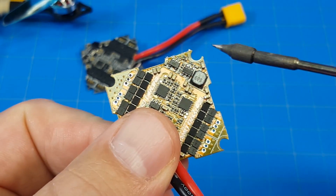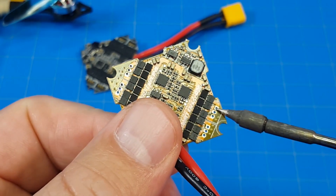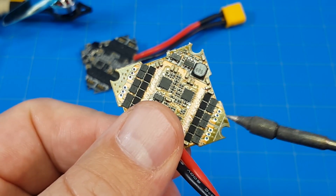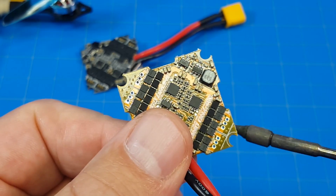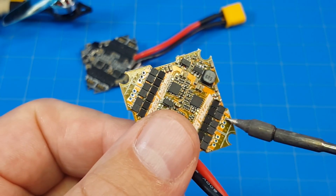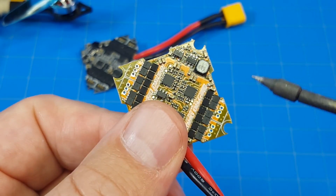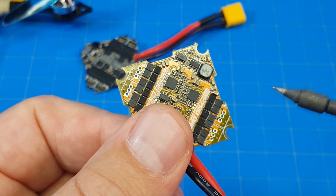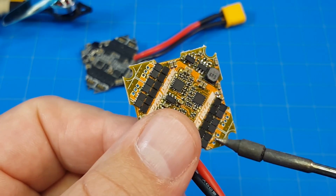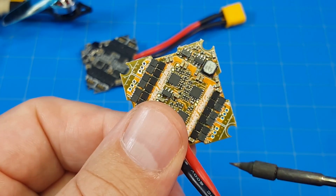The wires on that — like if you're wiring one of the Diatone Mamba motors, which has a much more standard or thicker sized wire — it's going to be a special sort of challenge to get these all on there and not have them touching. With the thin wires that come on those motors, I actually had a problem with at least two of them touching because I was using my smoke stopper and it would start to boot up and then stop. I had my magnifier out to find it and had to remove those two and try again. If you want to punch it through and solder it from the other side, I think that might be the best way, though I don't think that's going to be easy either.